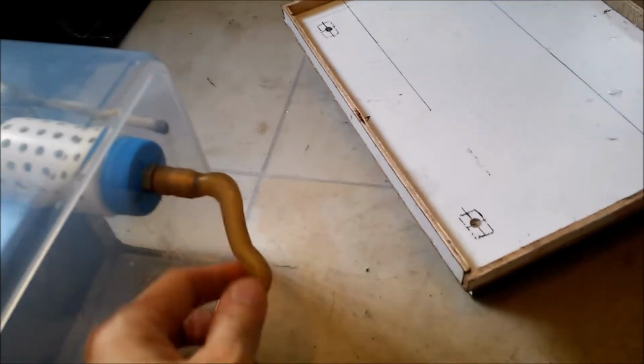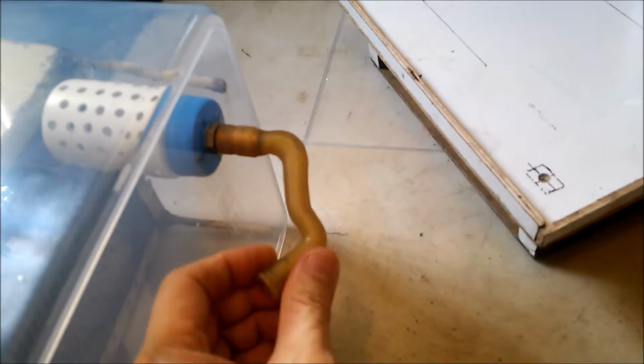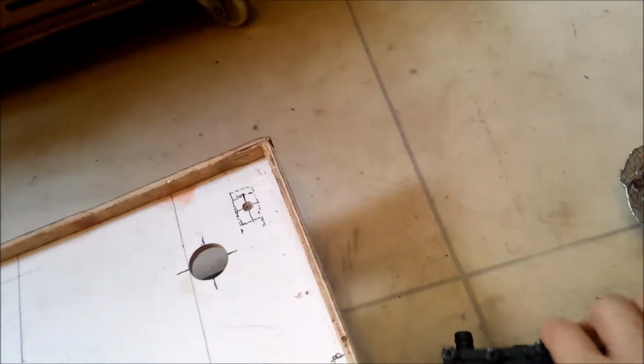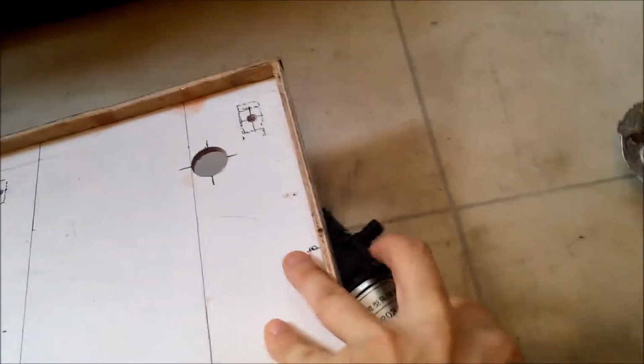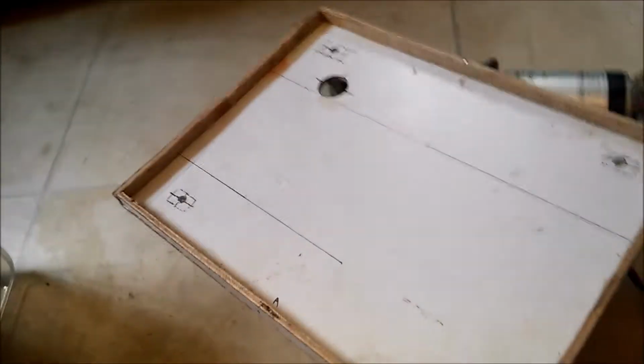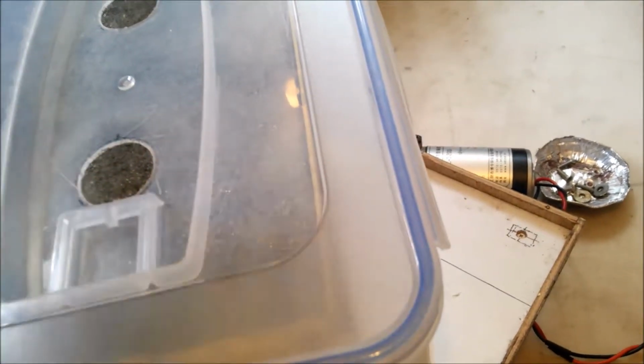and from the input side, this is a flexible tube, this silicone tube, and this tube will go through this hole and enter into this port, so the coolant will be circulating. The cooling tank is about the motor level or pump level, so it will go down and also suck into the pump.